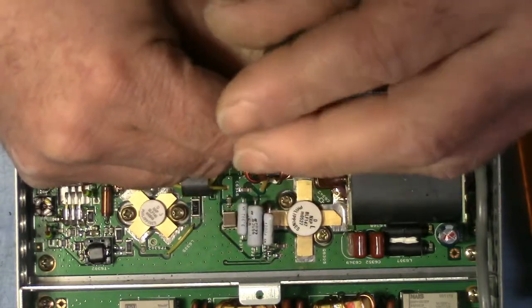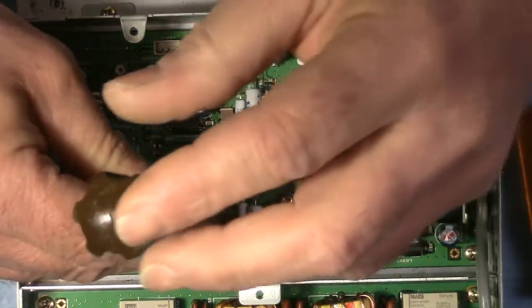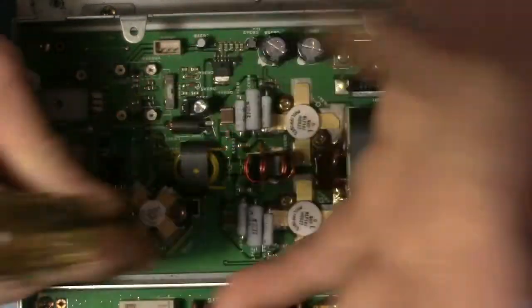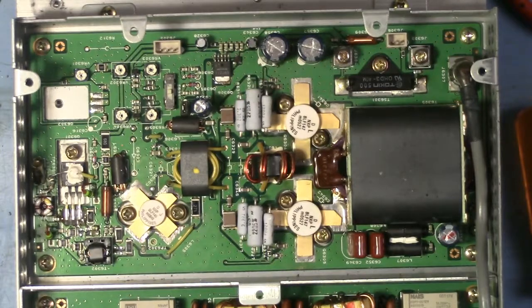So when you put a sheet metal screw in or a plastic screw in, it cuts its own threads. That's the point I'm trying to make. And if you just put those screws back together, you're liable to cut a new set of threads or a second set of threads. And if you continue to disassemble and reassemble, you're liable to cut many threads in whatever they're going into. And if you continue to do that, you will open up that hole until there are no more threads and the screw does not hold anymore.